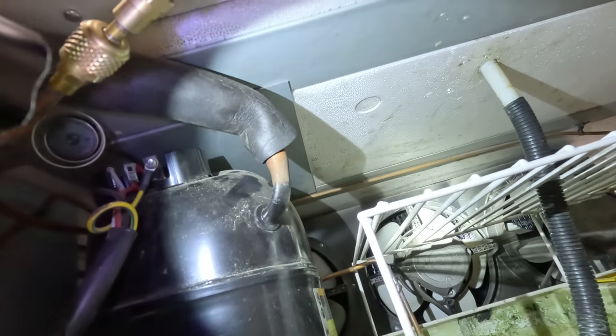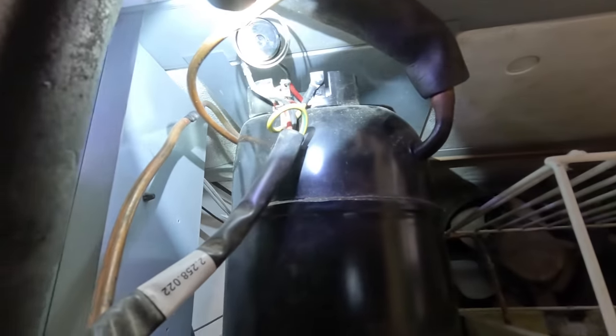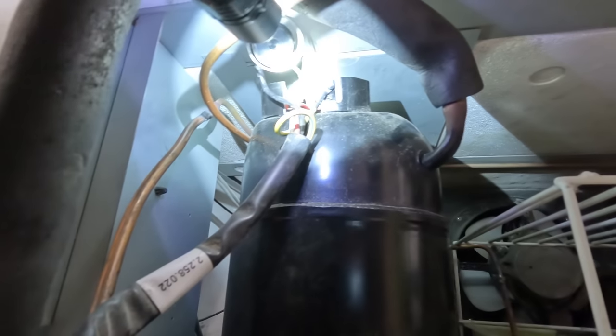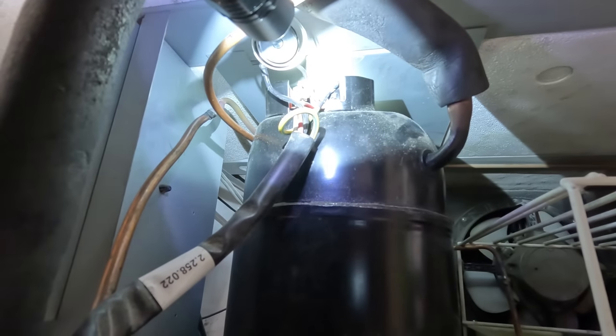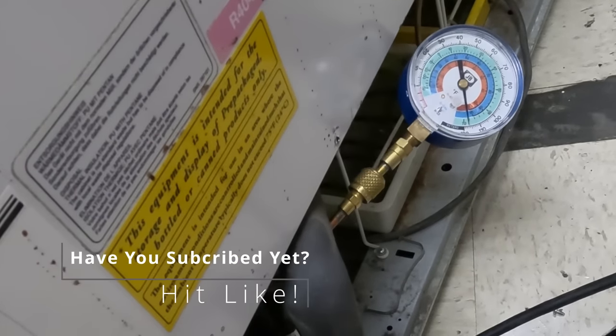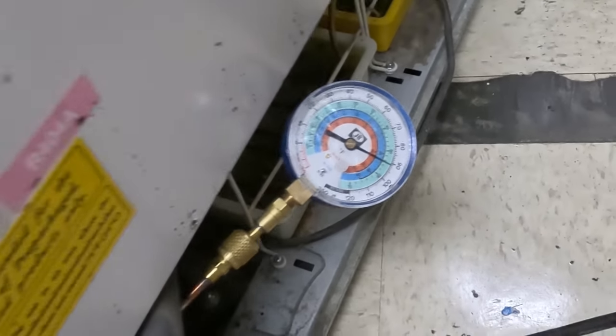Like I said, it could be because of dirty condenser coils, which were pretty packed full of crap. It was warm a day ago — it was like almost 80 and today it's like 40 something. That don't sound very good. Suction's holding in there about 40 psi.